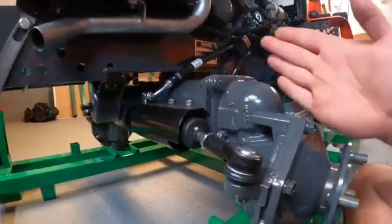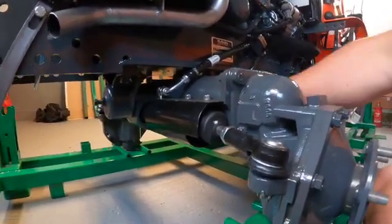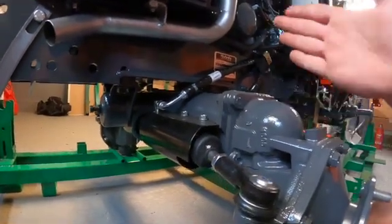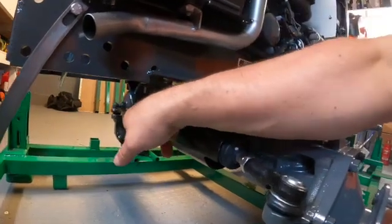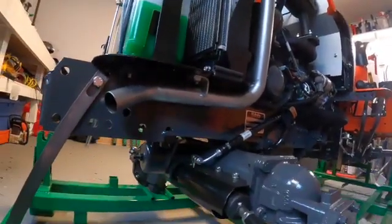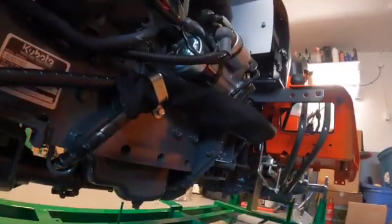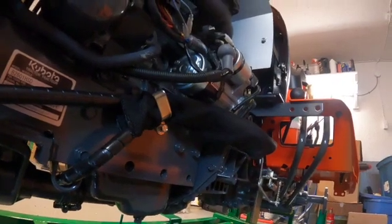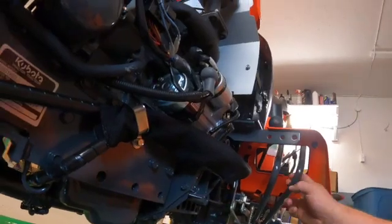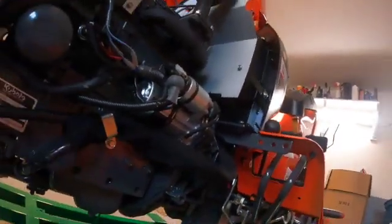But make sure your axle is not moving back and forth. That's just craziness, and it's going to cause extra wear. The forward and backward motion is adjustable, and if it's not in spec, it's going to cause extra wear laterally, so your axle is going to be going all sideways. Just correct it every now and then. It's an easy thing to do, not a big problem. So I'm going to come up to the brakes just real quick, and then I'm going to do the rear of the tractor on another episode.